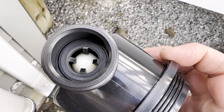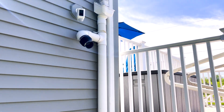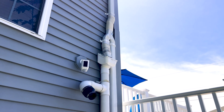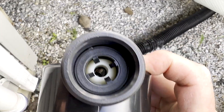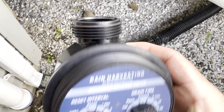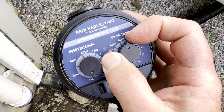The interval times on the new valve are based on the size of your first flush system. My first flush diverter pipe is pretty small, so the five-minute setting should work well. Depending on the system size and desired results, a longer reset interval will mean that the first flush diverter chamber empties less frequently, leading to a higher rainwater yield. A short reset interval will mean that the first flush diversion chamber empties more frequently, resulting in a lower water yield.